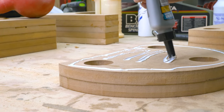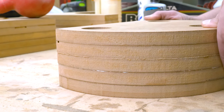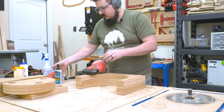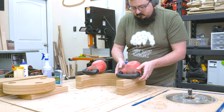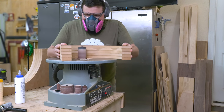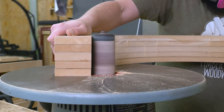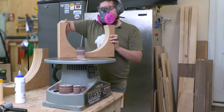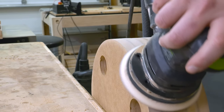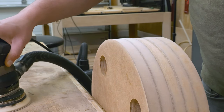With my templates all flush trimmed I could glue the sections together. As I progressed through these glue sandwiches I found that dumbbells were a lot easier than clamps. Once the MDF sandwich was dry, I used my oscillating spindle sander to clean up the inside curves — another option would be a dowel wrapped in sandpaper. The outside curve template cleaned up quickly with the random orbit sander, being careful not to stay in one place too long so I didn't flatten out the form.